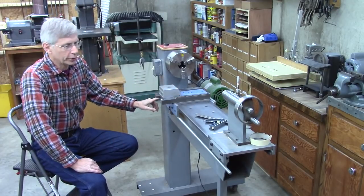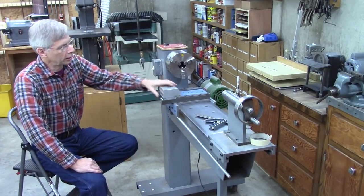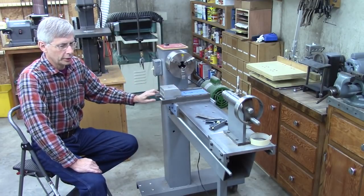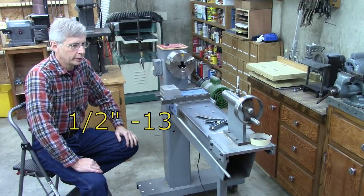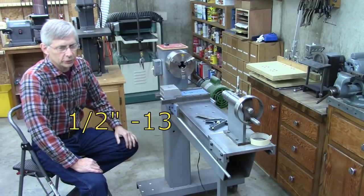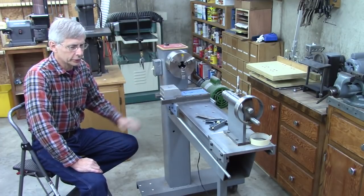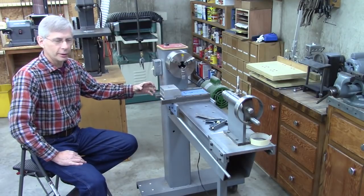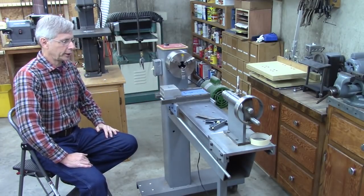Right now I'm putting a new lead screw on it. It had a 3/8 standard thread lead screw. I've got a cross slide lead screw ordered for it, but the carriage lead screw I'm just going to use a half-inch 12 standard threaded rod. I thought 3/8 was a little wimpy, and it had a wiggle to it — this one's nice and straight. I'm also going to make a NEMA stepper motor mount out here.